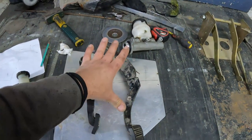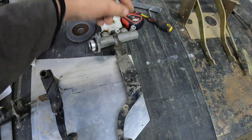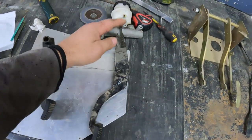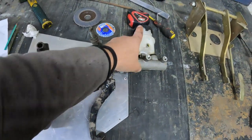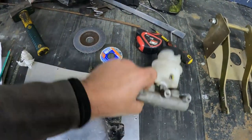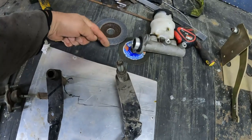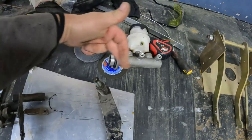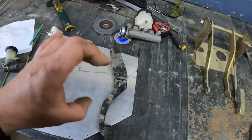The same goes for the brake pedal — it needs a ratio of about five to one. So if I divide the brake pedal into five pieces, the brake master goes at that point. Except I'm going to be putting it on top of the fulcrum on the opposite side of the brake, so I need to extend that piece so that pressing down on the brake engages the brake master. This one also needs to be shortened quite a lot.